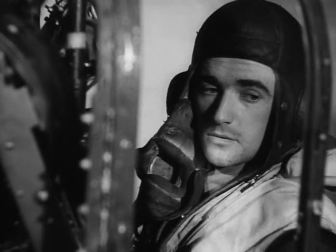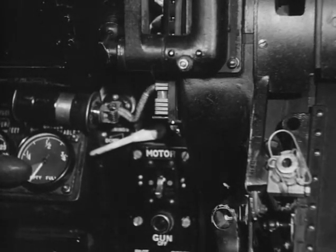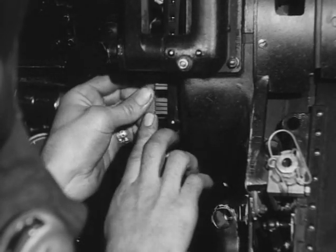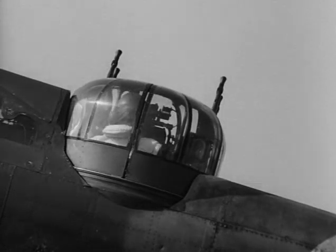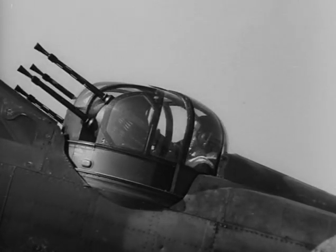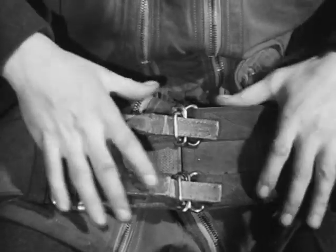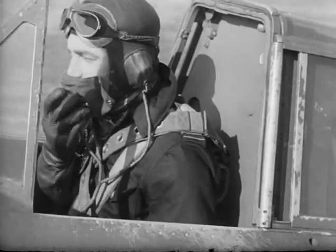But you can't power operate before switching on the motor switch. He had forgotten to release the armature switch on the control column before switching the motor switch on, and he has blown the fuse. The gunner should always make sure that he has got spare fuses available. This matter rectified, the gunner can now operate the turret, stowing guns in the forward position ready for take off. Safety strap secured. He reports guns OK to the pilot, and all is ready for the take off of his first training flight.